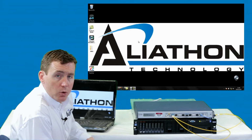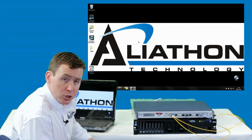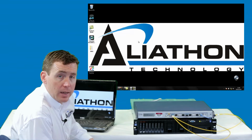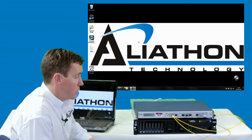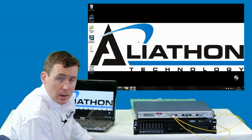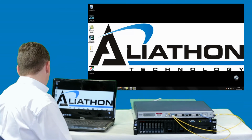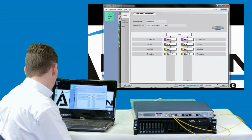Okay, let's move on now with our demonstration. The data paths chosen for today's demonstration are OTU2E and 1E, both carrying a synthetic 10 gig E client signal, and also a 10 gig Ethernet or LAN PHY signal. So we'll start with OTU2E carrying 10 gig Ethernet.